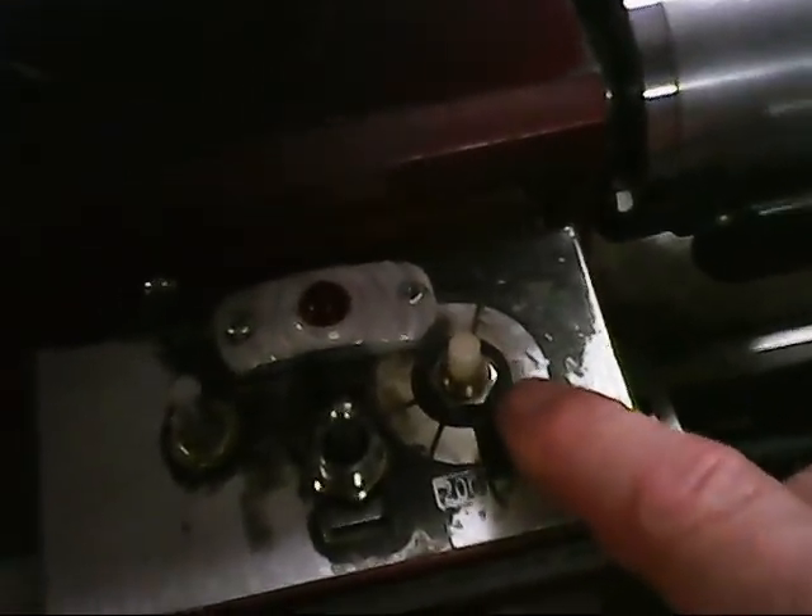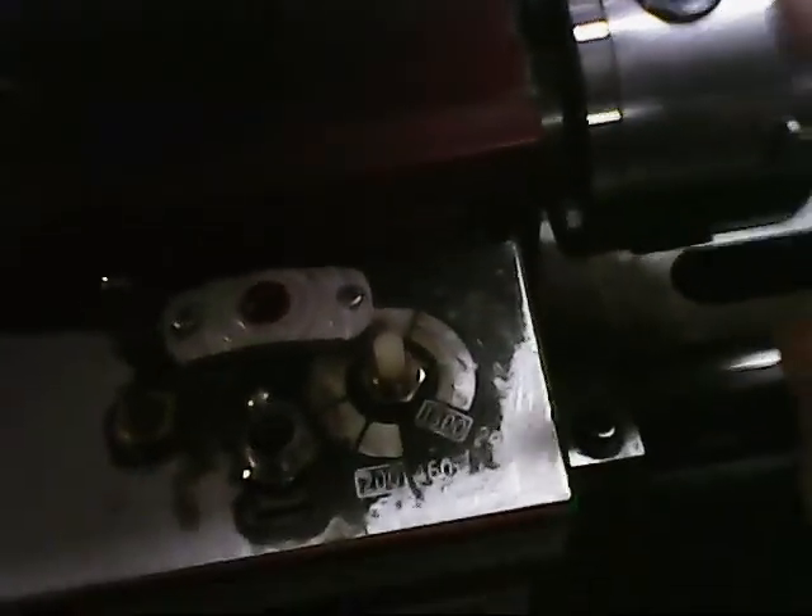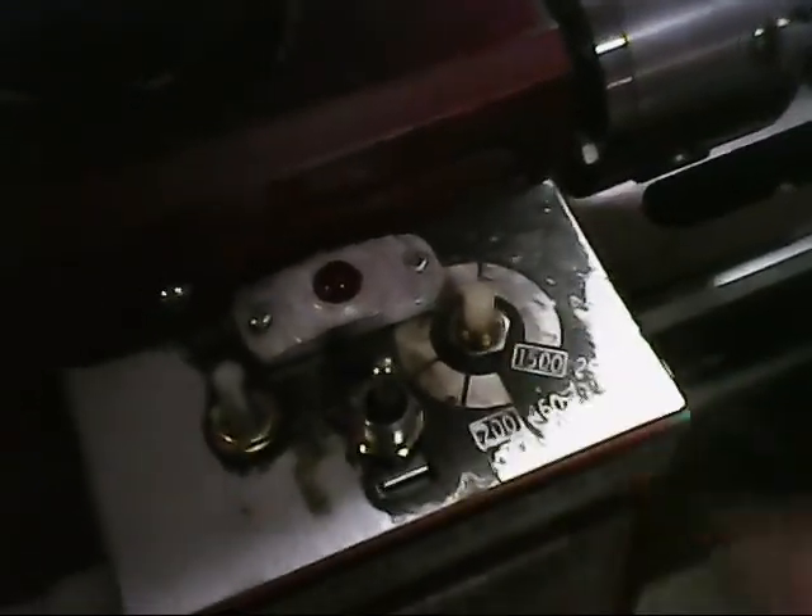Those are the waveforms showing how signals go from the input to the output of the circuit. Now we'll take a look at the motor and see how it's running. I got the speed control here — a knob for speed control. My indicator light shows feedback, and this is a fine adjust for the feedback. At high speeds I have to turn this back so the feedback is not so sensitive. This is a sensitive control.